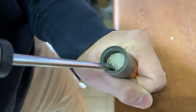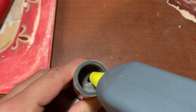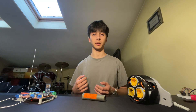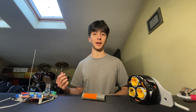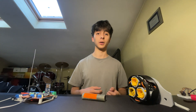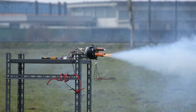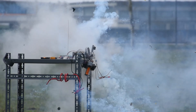After removing the ejection charge from the back, I sealed the whole thing with hot glue, thinking it would keep hot gases from coming out the back into the thrust vector mount — but the exact opposite happened. Residual black powder or the ejection fuse ignited, and the hot glue allowed enough pressure to build up for the motor to eject out and destroy the whole system.